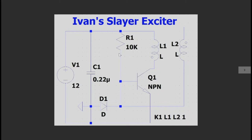After running some simulations, I found that the best value for my transistor, the BD139, will range from, let's say, 10 kilo ohms to 30 kilo ohms at our power supply voltage of 12 volts. I'm going to go with 10 kilo ohms because the lower your resistance value, the more output power you'll get, to a certain extent. However, again, it depends on the transistor, and the best way to determine this is experimentally